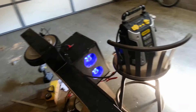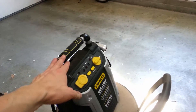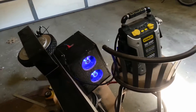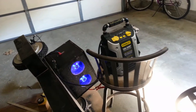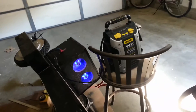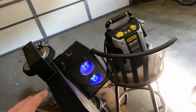Originally I expected this to be a three-part series, but now I'm actually thinking it's going to be a four-part series. Right now I'm running this off of the battery pack, but this is only 12 volts — plus a little bit more when it's charged — so it's not going to be running at full power. This whole thing was designed to run at 24 volts. The batteries you want are called lithium iron phosphate batteries, LiFePO4, and they're really expensive. So that's going to be the upgrade phase when it really gets to full power, kind of like the Large Hadron Collider — start it off at low power and slowly upgrade.